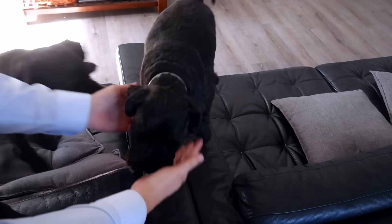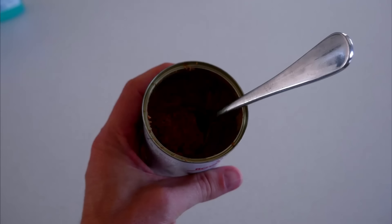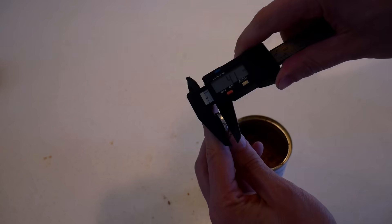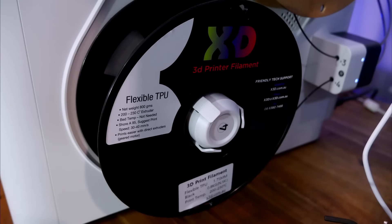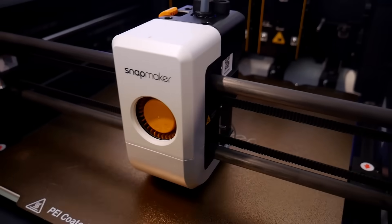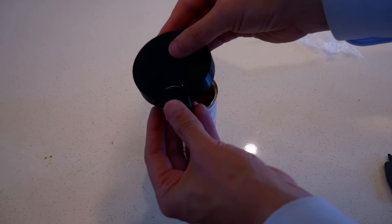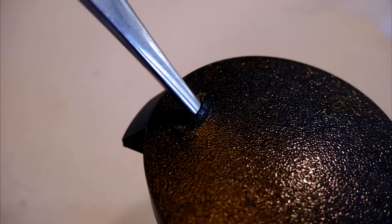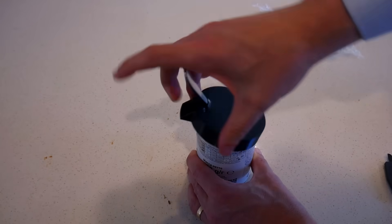They will be presented in arriving order, and the fastest was Michael from Teaching Tech. Just this week he completed a little practical project made from TPU. He took measurements of a dog food can, modeled up a lid in Onshape, loaded up some 95A TPU, and printed it on the Snapmaker U1. You push the spoon through the opening and then put the lid all the way down, clamping it onto the top of the can. The flaps give a nice seal, and the little boss makes removal quite easy.